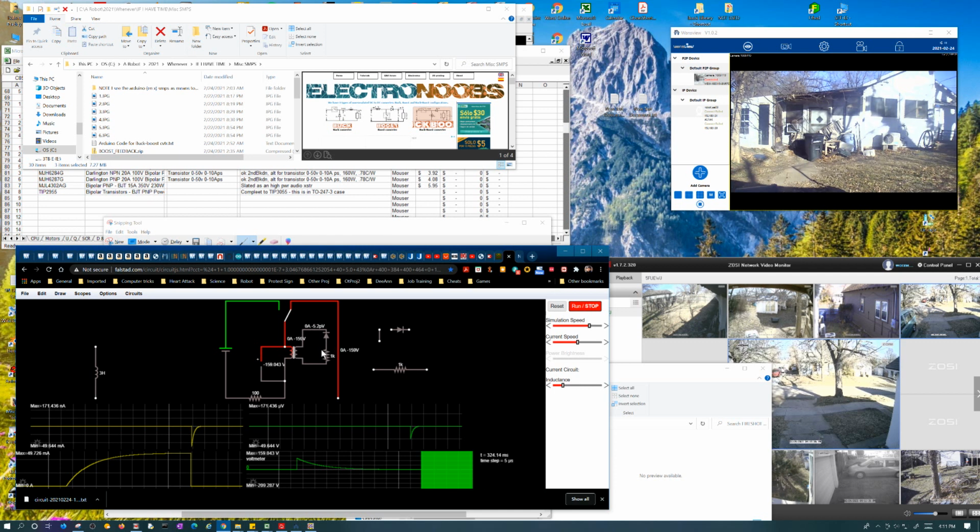It's trying to maintain that magnetic field, and that's what we're talking about. It's not the wire that stored the energy, it's the magnetic field itself. The energy is not in the wire, it's in the magnetic field. And especially if it has an iron core, or a magnetic core, it's going to be stored in the magnetic core for the most part, but more specifically in the field around the concentrated magnetic core. So you can take the same core and switch a wire to it.